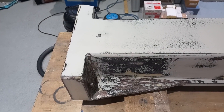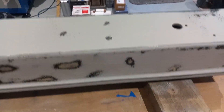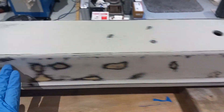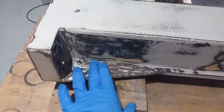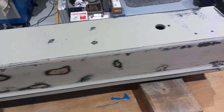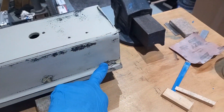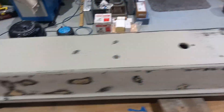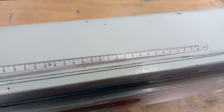I started on the column. I'm going to fill these where I've plugged the holes - it's not too bad actually. Down here the paint was pretty shocking and it was flaking off, but elsewhere it seems to be quite well adhered. So I'll rub it all down smooth and give it a coat of primer, a little bit of filling to do here and there, but it's actually not too bad, just a lot of graft.